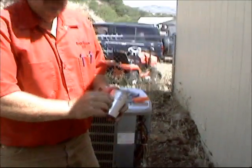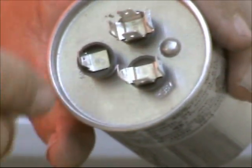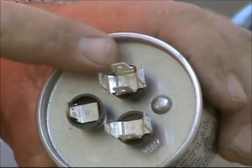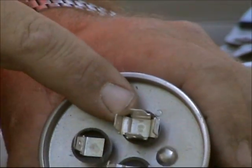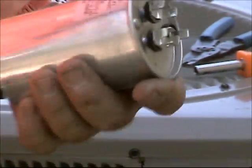Recap: you've got Common, Fan, and Herm. What we suggest you do is just take one wire at a time and put it in the proper spot. Your wire goes to the fan motor, this wire goes to the compressor, and this one goes to line 2 on the contactor. Very simple. We sell all kinds of air conditioning parts on my website at fixmyownac.com. I really appreciate you watching our video today on how to change a run capacitor.